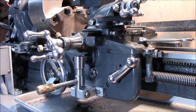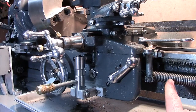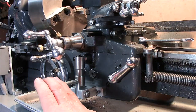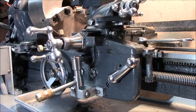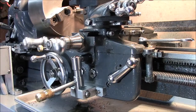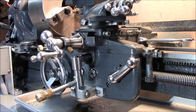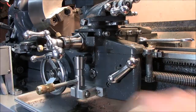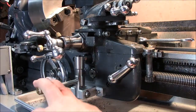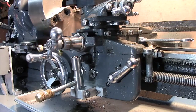Because I have a secondary lead screw drive, I can operate this without driving the lathe from the quick change gearbox. You can see the lead screw turning here. All we need to do to engage it is pull down this lever, and you can see that the cross slide is actually winding out. We can increase the speed of the motor, slow it right down, stop it, change direction, and re-engage it.